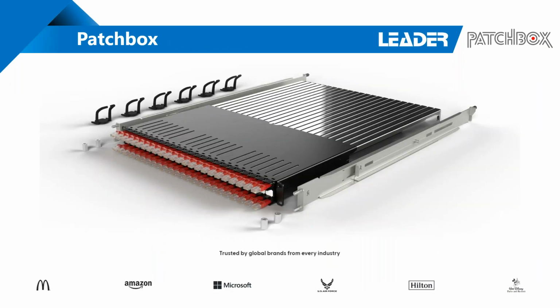So as you'd imagine, all of the cassettes are interchangeable. So this is an image of a fully patched panel with full 24 ports all done and sorted, but you can get different cassettes. So you can get different colors. You can also get different cable types. So all of the ones that we sell are Cat6A, which is great. You can use it with PoE and all that sort of thing. You do also get fiber optic versions as well, which are order on demand. So you can get multi-mode, single mode if you particularly work in the fiber optic space. Nothing wrong with that. And as I said, all the cassettes are interchangeable.